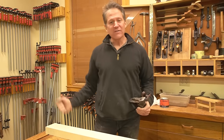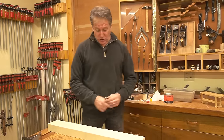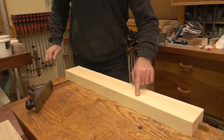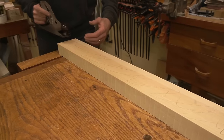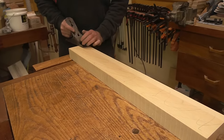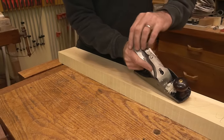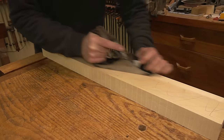Do not try to take off an eighth of an inch. I'm backing this off now, getting it nice and even and thin so we take off a nice shaving — we're not going to fight this. Here I've got pine, which is a great wood to start with because it's so forgiving and so fun to plane. If you scribble on the surface, with the light bouncing you can see the joiner marks — they're ripply all the way down. I want it coming out evenly; I see it's coming out a little to the right so I'll adjust slightly.